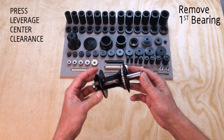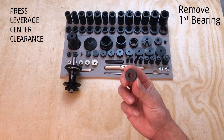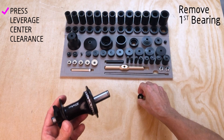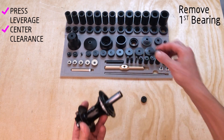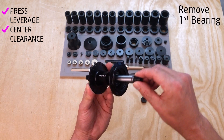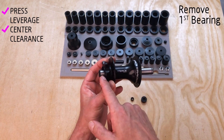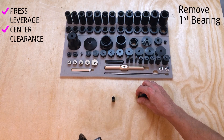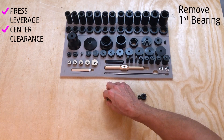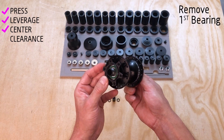So let's pick some pieces. Up against the axle, we'll use a drift to press against the end of the axle. For centering, we'll use pilots that fit inside the axle - we're going to use two pilots, one at each end, to keep things really stable. We'll use O-rings to keep the pilots in place so they don't shift around.